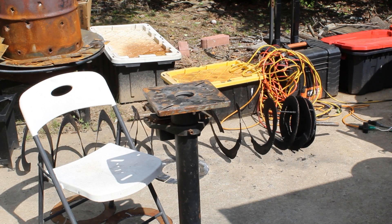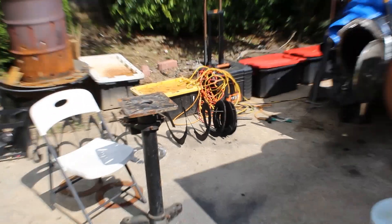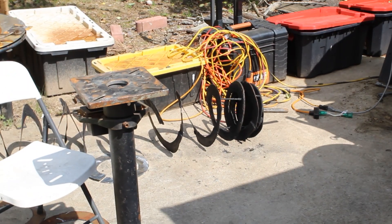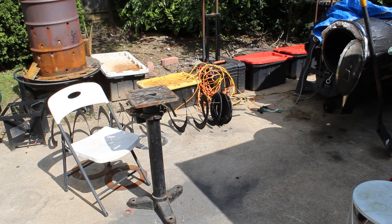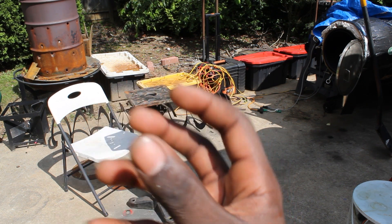These are ground down nice and good. A lot of people suggested that I put some rods throughout the whole part of the blades, kind of like how I put rods down here in the beginning. I'm going to explain why I'm not doing that. One of the main and biggest advantages to this being a shaftless auger system is that it allows microwaves to pass in between the gaps between the blades and not be reflected by a big shaft. But even small shafts between all of them would be problematic, primarily because of me doing this by hand — the inconsistencies and imperfections will be completely shown in the fact that some of these blades will be floating.